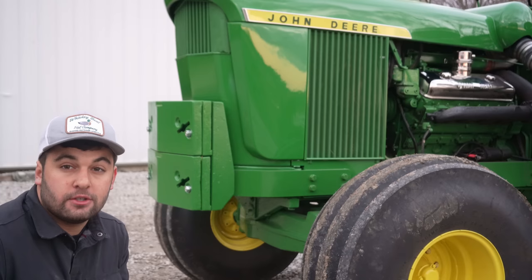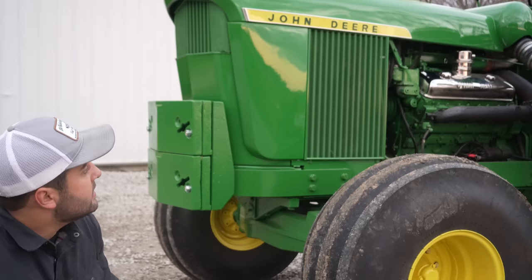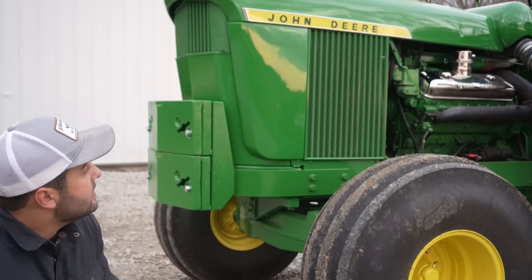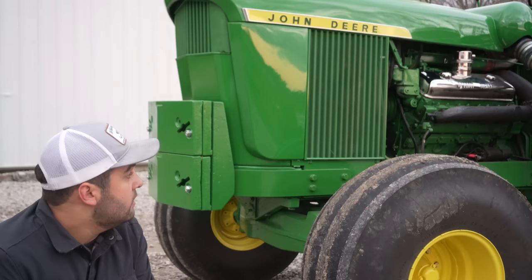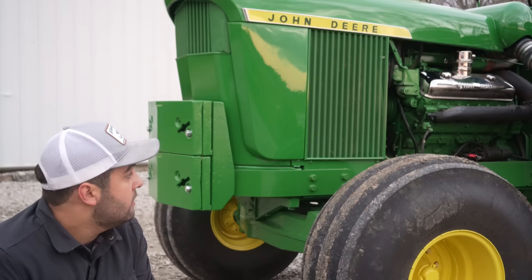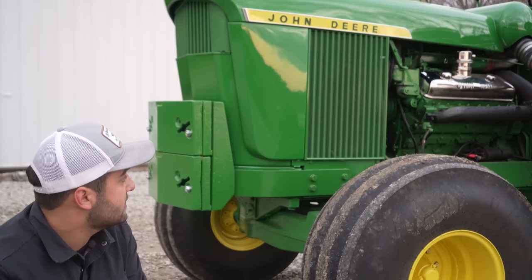You've probably noticed there's no decal on this tractor — no 5010 or 5020 decal. That's kind of because it's both of them; we've got parts from each tractor on this one. It's got a 5010 fuel tank, 5010 front axle, 5010 dust shields, and Wheatland fenders. Then the transmission and all that is off of a 5020. When we got this tractor, the transmission had some major problems, and we knew of a guy that had a 5020 with a rebuilt rear end. So we bought that, split both tractors, swapped the rear ends, and put it all back together. So it's got parts from both, which makes it kind of hard to label.